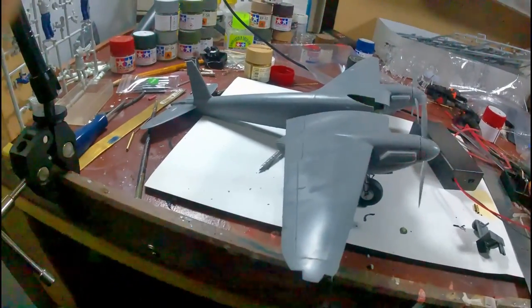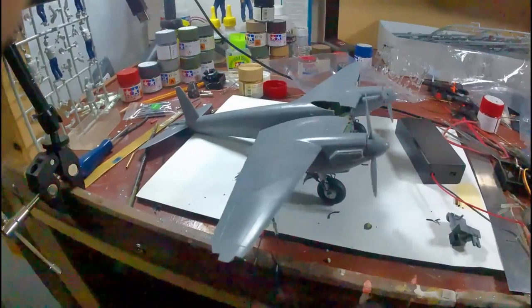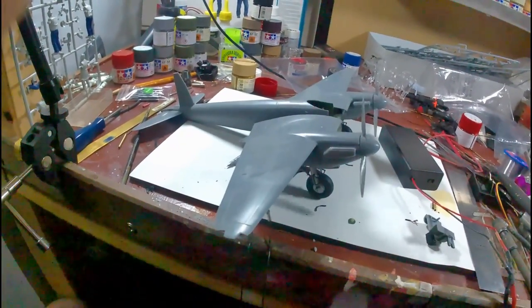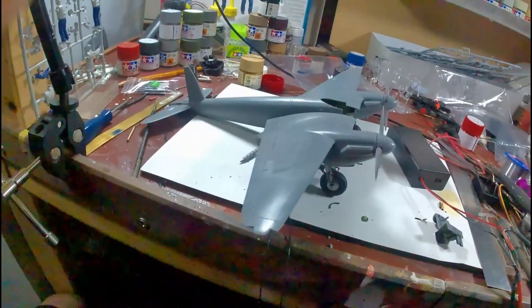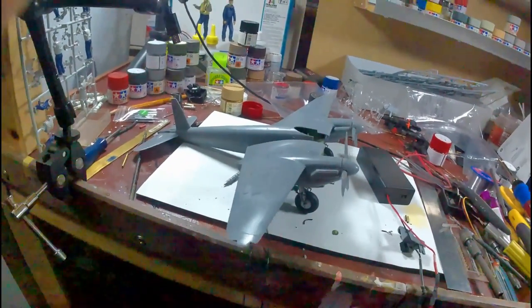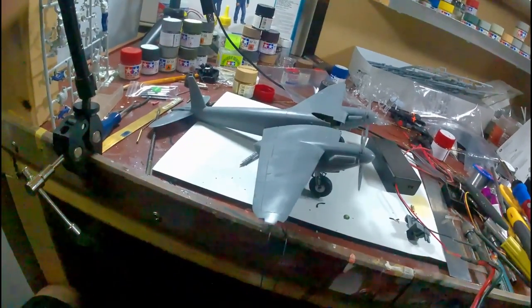I can't imagine how fast this is going to go once I've got it all together with the RC speed controller on it. Like I say, in there we've got 55,000 RPM, 3.7 volt motors. I can't take the speed control that I've got on it any further than halfway anyway, because it's powered by 7.2 volt batteries. Now, be wary if you're going to head for this project as well.